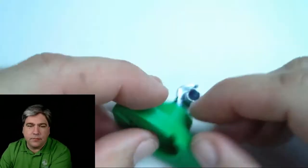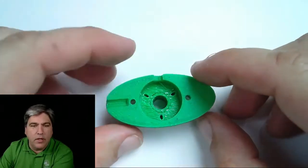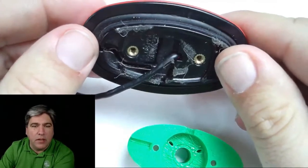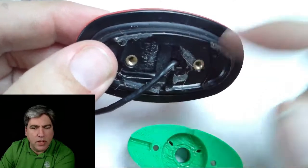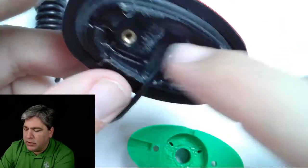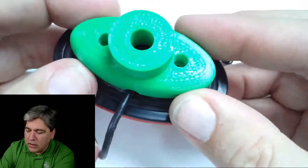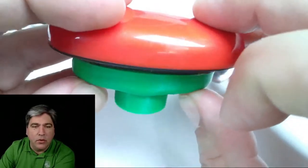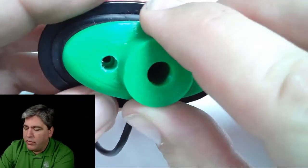What I've got here is a 3D printed back for this old-school jelly bean — not the jelly bean twist, but an original jelly bean button. You'll see it's got two threads on the back: these are the 6-32s, the other ones are 4-40s. Not very standard threads and also kind of difficult to mount with the little lip here. This has been designed to allow the cord to come out and give you room for that, and then this will fit right on top and give you the ability to mount it on a camera mount. It's a nice design — it's got room for the screws here, but we've got to get the thread into it.